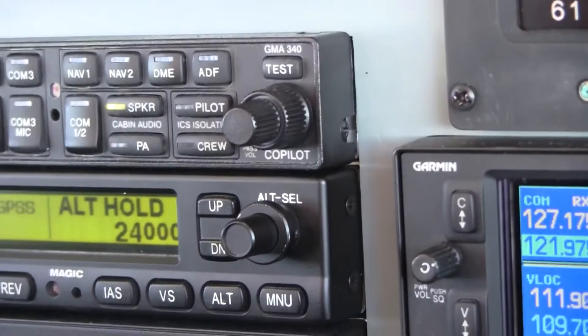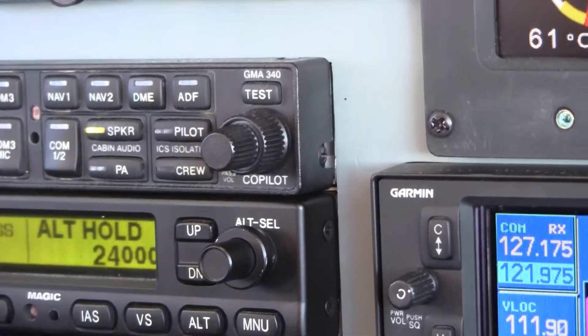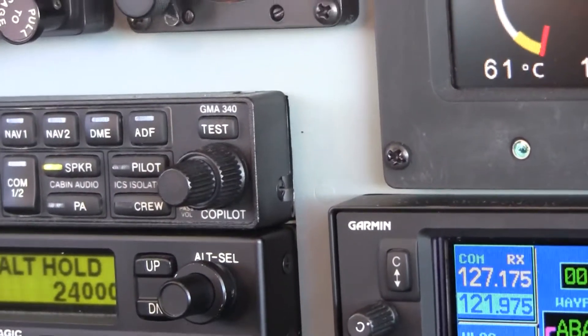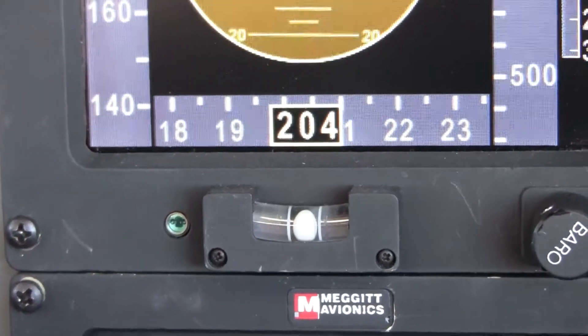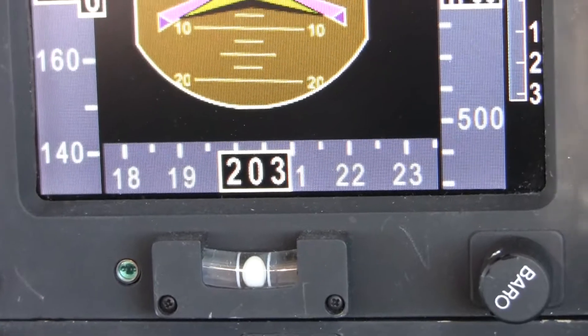No, don't adjust the vernier. But now you're going to turn it to get the ball to move to the left. Turn it clockwise — just a few degrees, just a little, just a skosh. And then wait. Stop turning once you've done that. You see the ball come centered. Move your hand away. It's now a little bit more to the left.